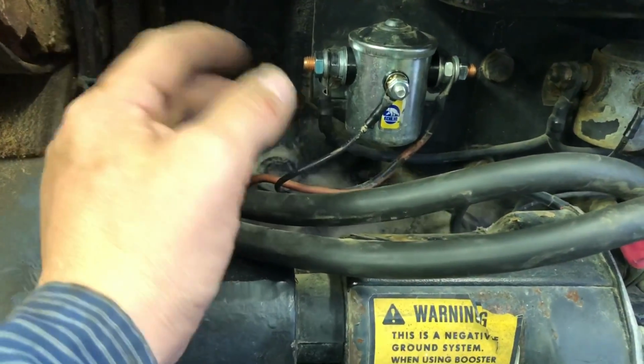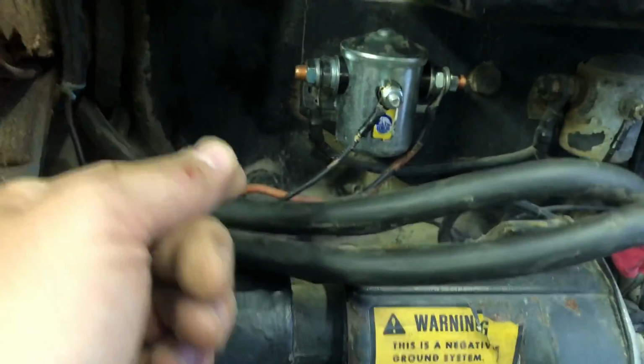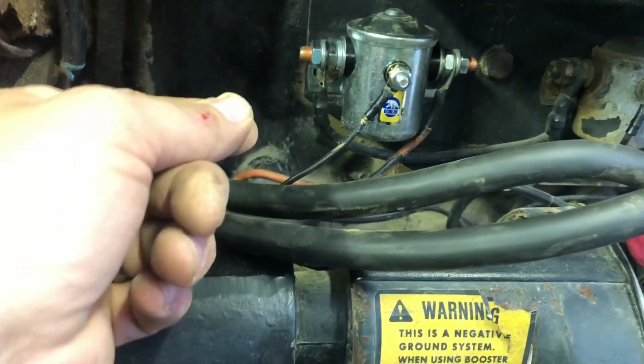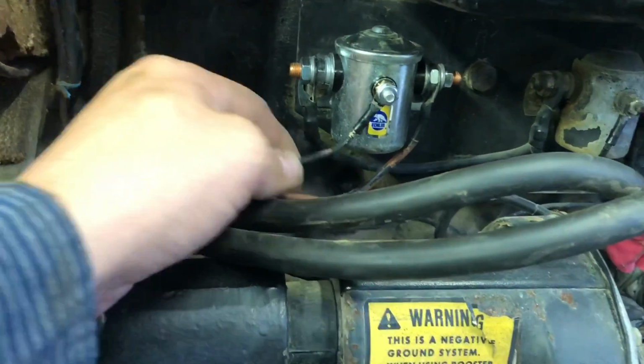It could be low voltage or whatever, but in this instance, it's the same voltage, but it's low amperage. So you can have a cheap switch, like a 5-amp switch or something, or even less. And you can switch, say, 30 amps instead of having to have a 30 amp switch to send all your power through. So this is your signal wire.